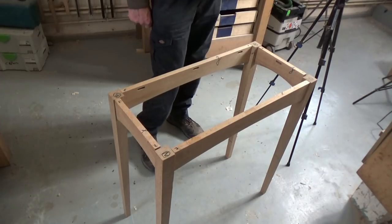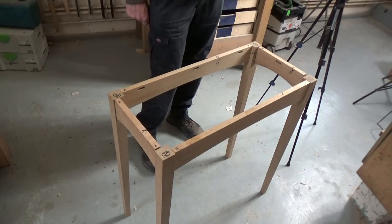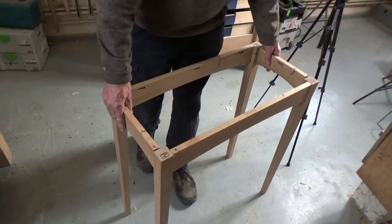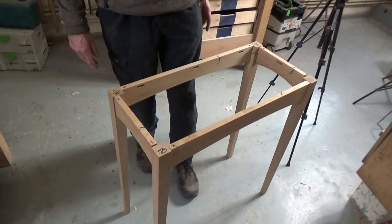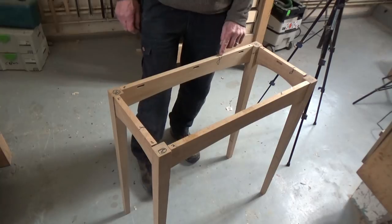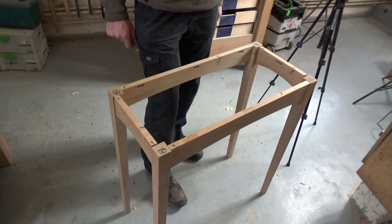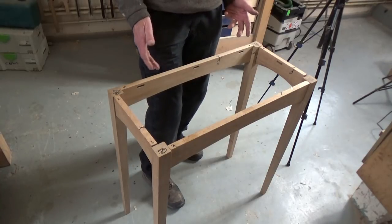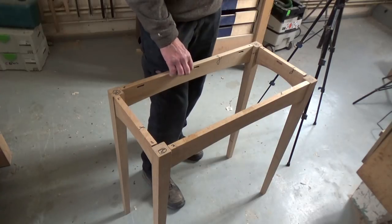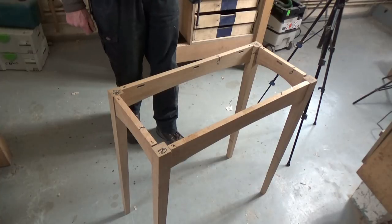And I'll now take you on to an even more complex arrangement, and we'll see how it works in that. One thing I would say is that you do need to be fairly bold about your marking. I sometimes find people might make little tiny marks with a face side, face edge. It really defeats the point of it being there, because they're supposed to be obvious to avoid you making mistakes. And if you've got little tiny markings, it's a lot easier to make mistakes.